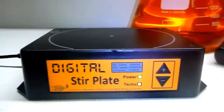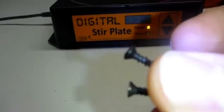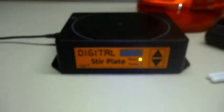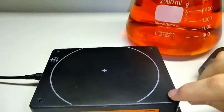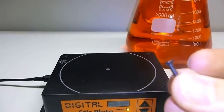Another thing we changed was our mounting screws in the top of the enclosure. The previous screws had a bit of a rounded head — you can see that top one there. Those were the ones that came with the cases originally. The trouble is we have a lot of brewers who are brewing 5-litre starters for double batches, and if you have a large 5-litre flask it can sit so wide on the base that it was sitting on the heads of the screws just a little bit. It wasn't the end of the world but it just wasn't perfect either. So this time we've sourced some better screws that now give you a completely flush surface.